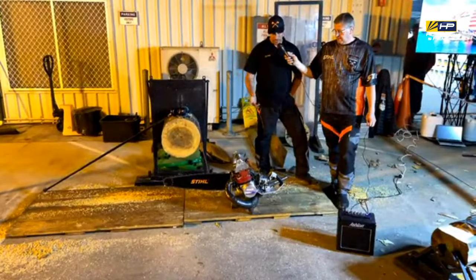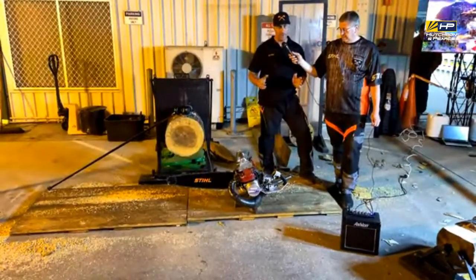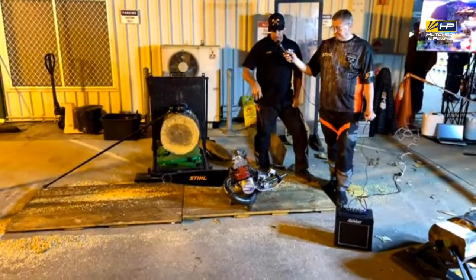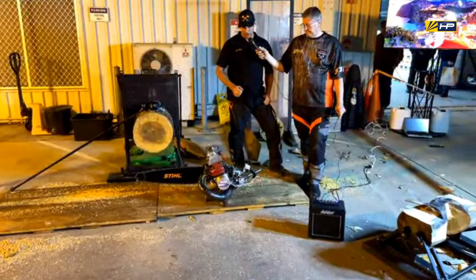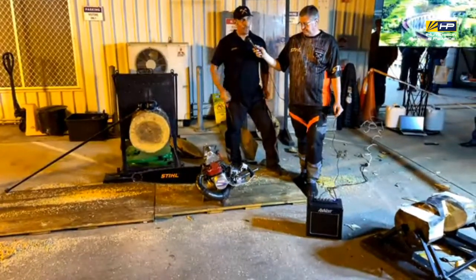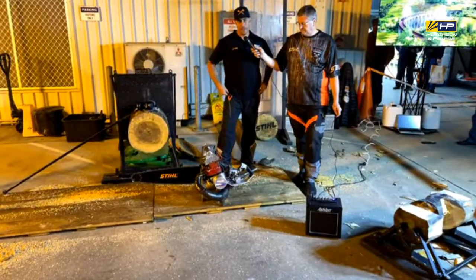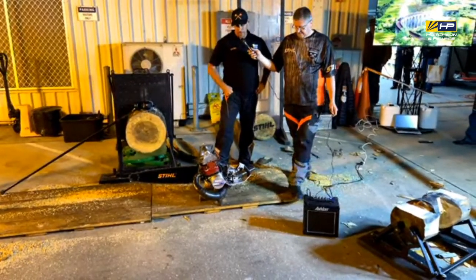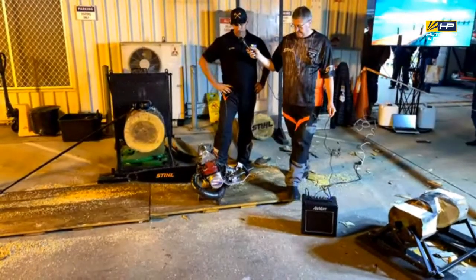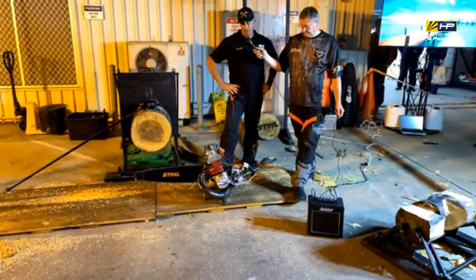As I said, that engine is out of a snowmobile. It was three cylinders and they've been separated down to just one cylinder. So it's just direct drive straight off the crank. You've got no chain brake, anything like that. As for sprockets and sizes, that's 404 chain that we run. There's a 17.2 sprocket on that, so it's about 75 millimetres diameter, and about 270 kilometres an hour chain speed. So very powerful, about 65, 70 horsepower they put out.